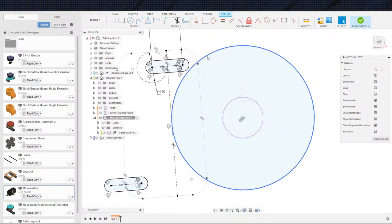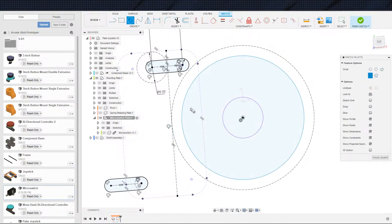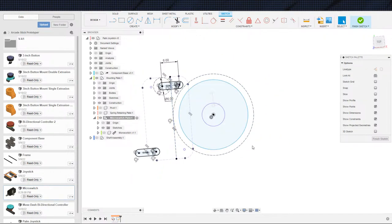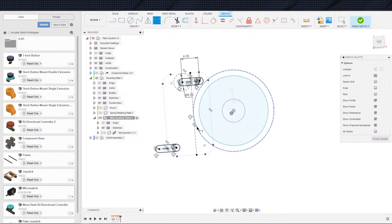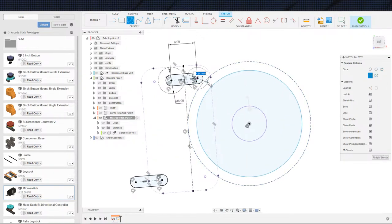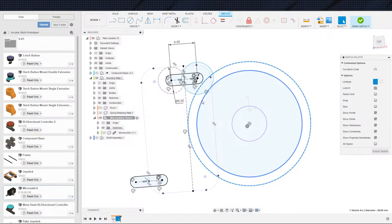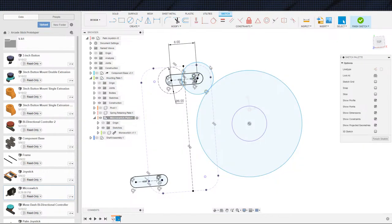That is a bit tight to there, so let's do this then. Again, this doesn't really need to be this far because the actuator is going to go ahead and hit the micro switch down here. So that actuator is going to give us a little extra reach, which is why we don't need to actually have this clear all the way up this line. That's the rationale there. And therefore, in order to give myself a little bit of meat here, I'm going to do this. And actually, that is a good point. I can delete this guy altogether because I'm doing it this way.